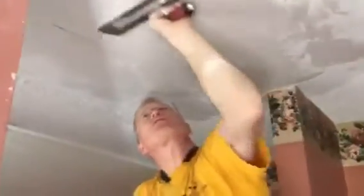Now I'm going to put it on a little thick here because that's where the problem area was. I got a little plaster left down there in case I need more. Now remember, this is not the finish. We're almost finished. This is called a rough application because we're not done yet. We're filling in the whip. Even though it might look nice and flat to you, it's nowhere near done. So now we're going to test it with the big tool.